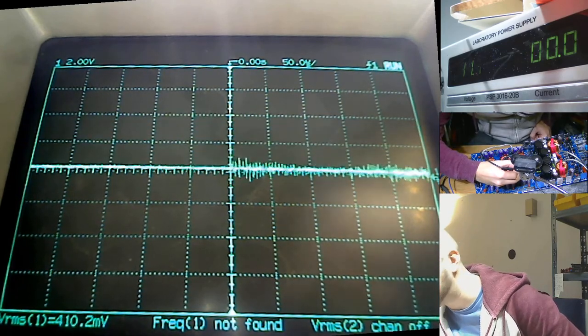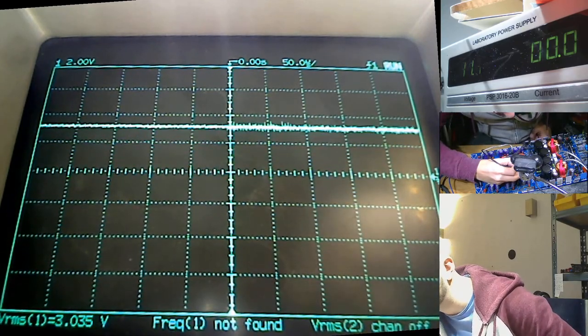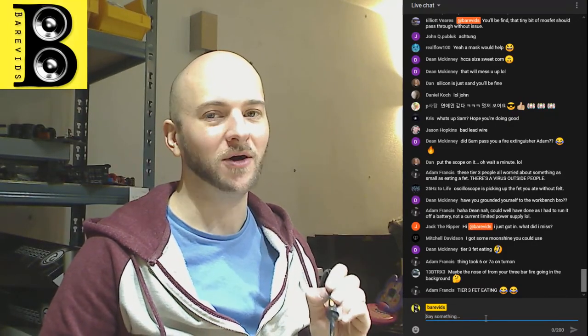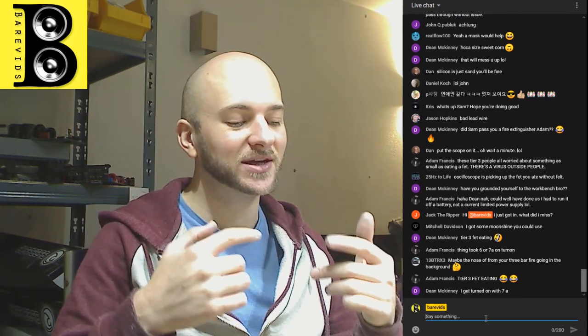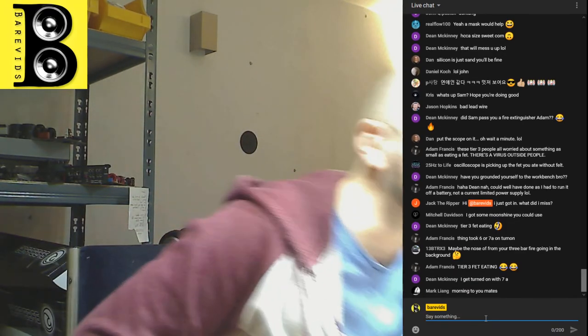It could also be though that the drivers have failed and they're sending that DC back, but that's not usually, even when the drivers are screwed up, you'll still get the PWM on the TL494 because there's the high resistance, but there's usually a high value resistor between the TL494 and the drivers here. Okay.